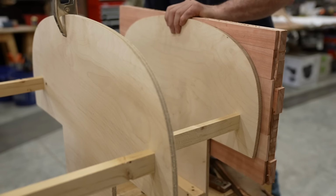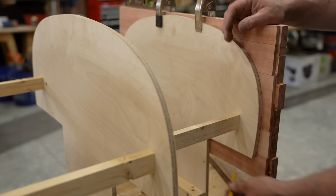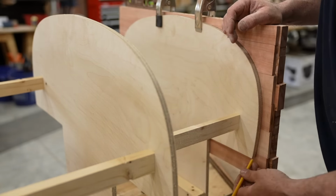Now this is the transom, and you'll see here I kind of had to layer it a little bit to make it a little bit wider. That last mold station is the transom. And so I use it as my shape. And now that's the shape at the top, so I'm just using a little piece of flexible wood. And I'm using my big giant bandsaw.